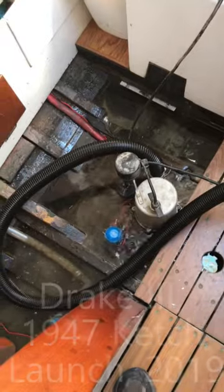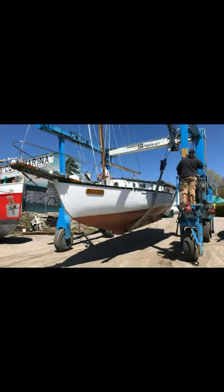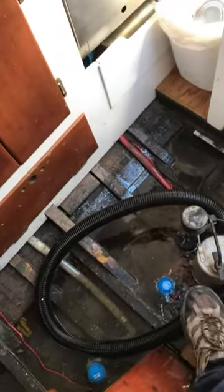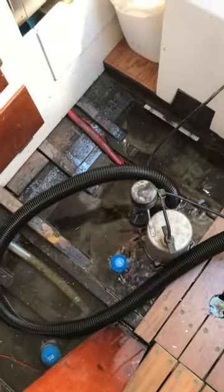Here we are aboard Drake. It's May 15th, and it just went in the water. There's always a couple of troublesome spots in this thing, so I used the sump pump right there — the sump pump rather than just the two bilge pumps — in order to get the boat well immersed so the planks will be wetted so that they'll start to swell up.